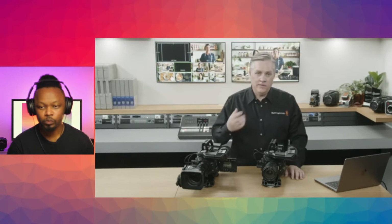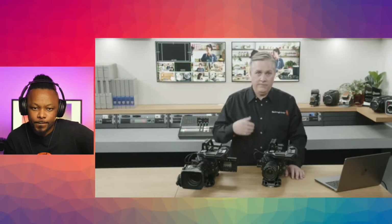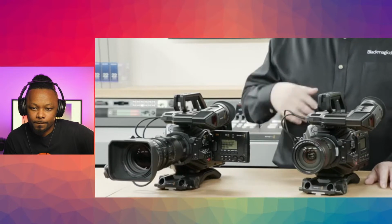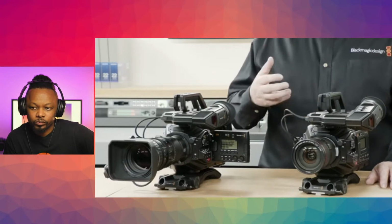SDI formats. Now, these are like professional versions of those codecs. Normally, H.264 and H.265 codecs are 8-bit 420, which is fantastic for streaming and archive. It's also pretty good for a lot of camera files. It's tight and compact. But our SDI versions of the codec are 422 and 10-bit. Plus, they have quite low compression rates. They're very high quality. And the reason we've called it SDI is because it's the same video quality as SDI video, which is also 422 10-bit. So it's the same quality as the video connection that's used through broadcast.